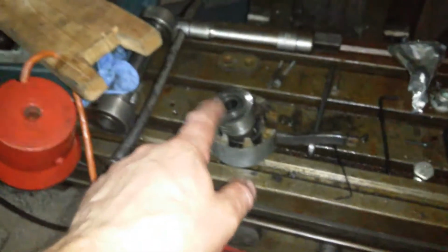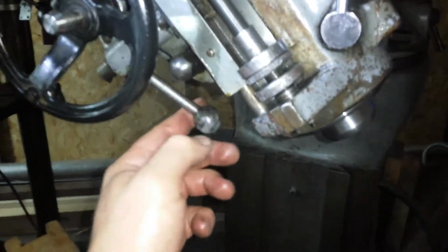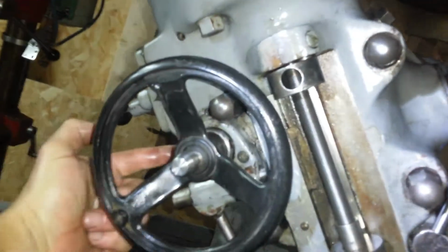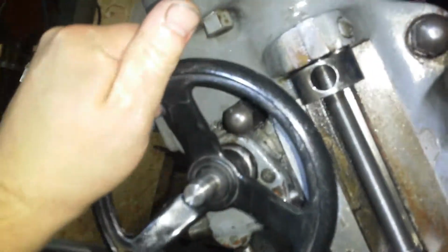So the gear which attaches to this, which is for the power feed switch here, that lever comes off the back here, hold on, and goes in that hole just there. Well, that gear inside there is not turning. So the power feed shaft which goes down into that gear is not being engaged, and I think it's broken because I can hear it.